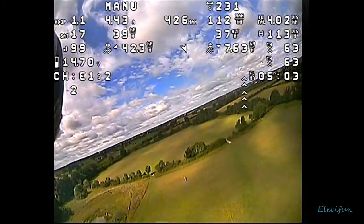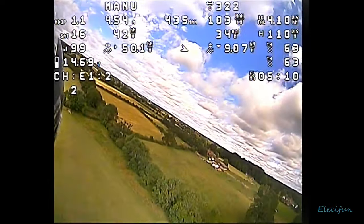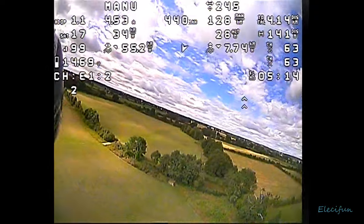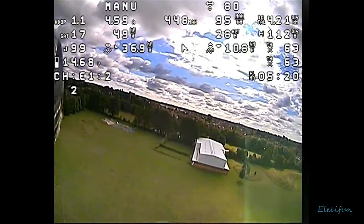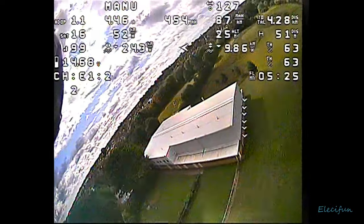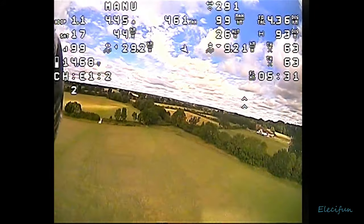I'm pretty chuffed with myself - I'm in manual mode and everything seems okay. I like the idea that it's not using too many amps. At about five amps average, I might be able to use 18650 batteries and make a battery pack - at say three amp-hours or something - with some of those Sony VTC6s, I think that's what they are.